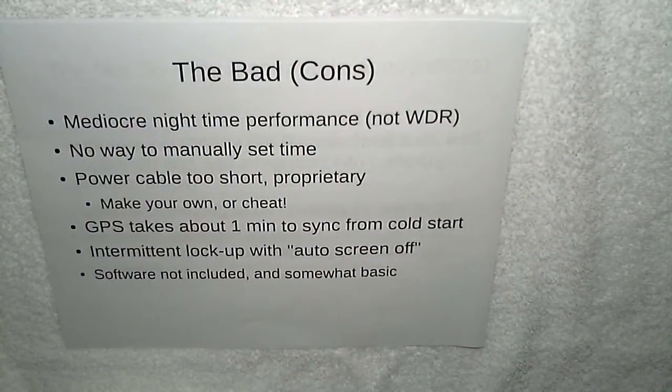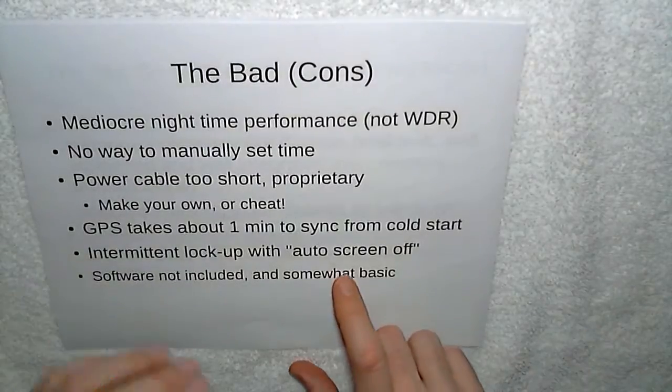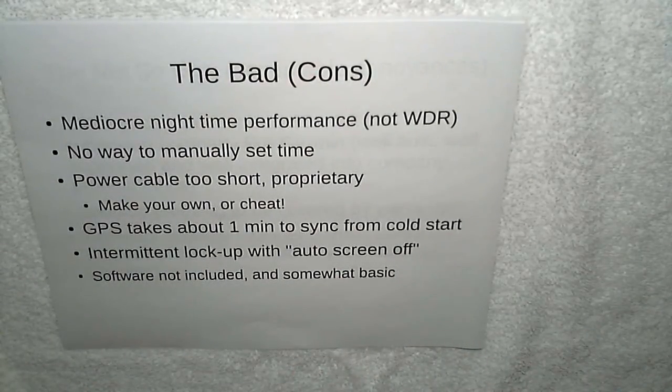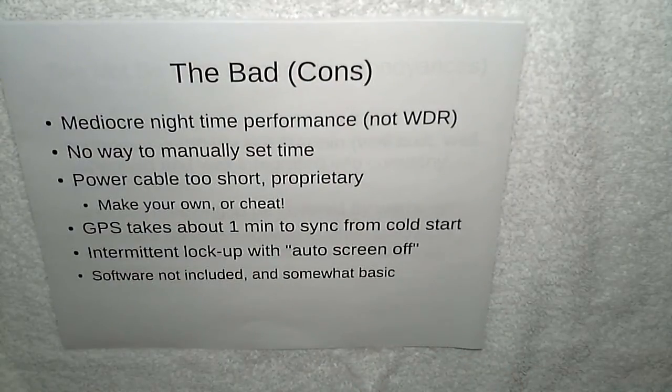Software's not included in the camera, unlike you saw in some of the examples from Video 3. This is probably what you're going to find typical with most of your cameras outside of those SG based ones. Like I said, every one of those is built the same, uses the same basic software. This is a particular brand, particular model using particular chipsets, so you're in the wide range of dash cams now, where they go from Novatek to Allwinner to the Ambarellas, to all the other kinds of chipsets out there. And so typically they don't have a built-in player. This one does not. Now you can download a player. The whole point of this was, again, simplicity. You plug it in, it looks like a USB device, you review your video. You don't have to have a special player to pull back any of your GPS data because it's there on the screen. It's already burned into the video file.